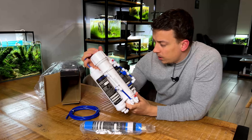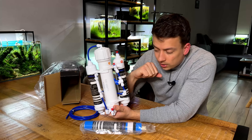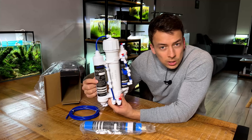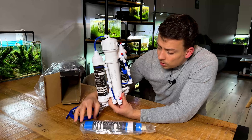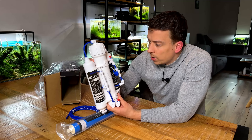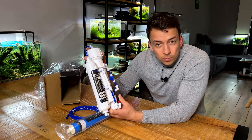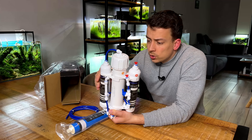So this is our reverse osmosis filter. To give a brief explanation, it's a three-step process. The first filter is the fine filter that catches sand, dust, and larger particles. The second is the carbon filter, which catches chlorine if you have any in the tap water. Those two filters are already inside. The only filter we still need to add in the larger chamber is a very fine membrane that catches all the heavy salts and heavy metals. Then we flush the system for about an hour.